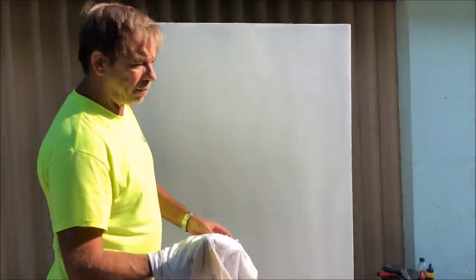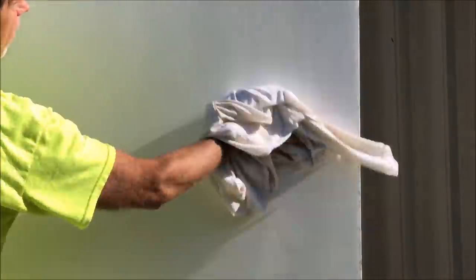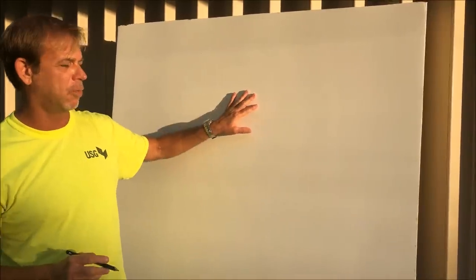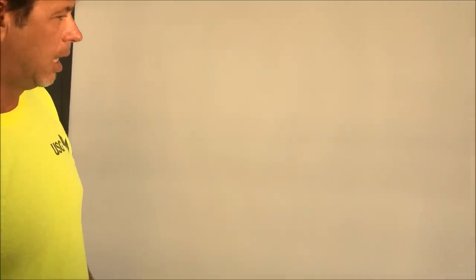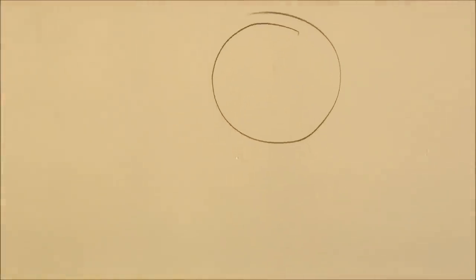It's an old t-shirt just to wipe the dust off. So here's where the pencil comes in. What you need to do is mark any areas when you've got good light on it — whether it's from natural light or a halogen or LED light that you want to shine on it — you can see a lot more with the light. So I'm going to go around where I see any areas that need work, like a scratch or any divots, and just put a mark to put my colored mud in. No question — you want to mark everything you see.